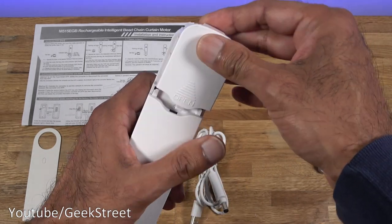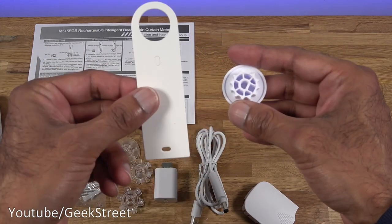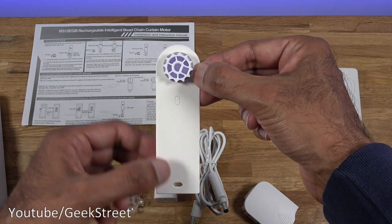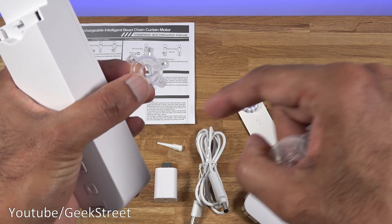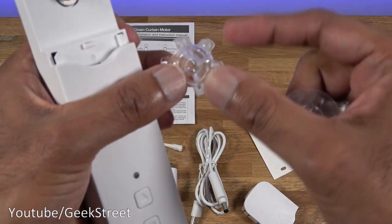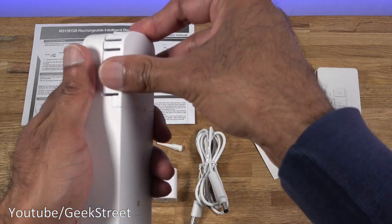Looking here it says 'open' — slide it up and you've got the place where you put the cogs. There's a temporary one in here, and if I pull that off, that's actually used when you're installing the device. The way it works: you take the template, put that in there, hold it against the wall with your bead chain around it. Once it's nice and tense, you can mark where to drill, then work out which cog to use. Fit it on, marry up the notch, and slot it into position — push it in and put the cover back.